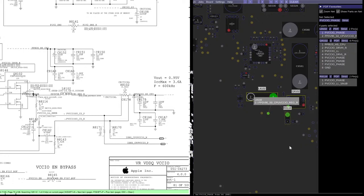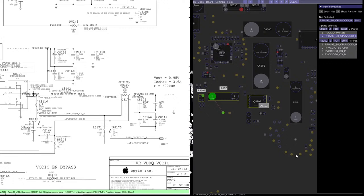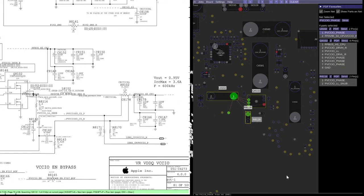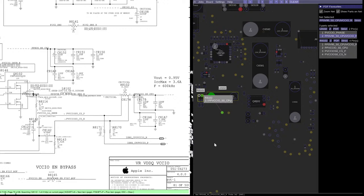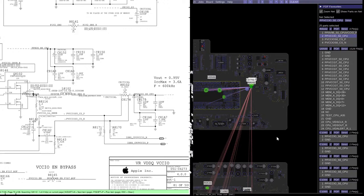And it's all controlled by the chips that we're talking about on the other side. So the chip, this is a buck regulator. It takes 5 volts, and it turns it on and off a certain amount of times with the specific timing, so that on the outside here, with a couple capacitors and inductor to smooth it all out, you get an average of, on this one, 0.95 volts. That goes to the CPU to power the I.O. of the CPU, I believe.